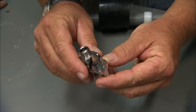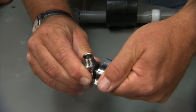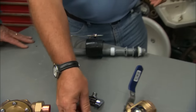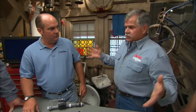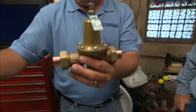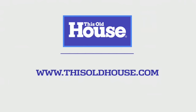You can tell it's open with a quarter turn — there's open and there's closed. And so if you want to balance it, you can just throttle it back a little bit, unlike the stem valve that turns about five or six times and really shouldn't be throttled down. Isn't it true that if a faucet is splashing out too much, lots of times the house just has too much water pressure? And so if you've got too much pressure on the whole house, you really want to introduce a pressure-reducing valve, and that's on the water main coming in from the street. High pressure on one side, you can step it down to a manageable pressure on the other side.